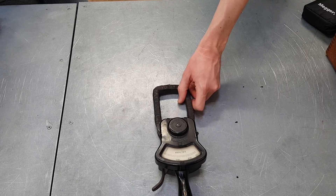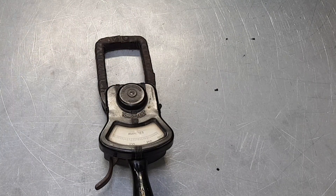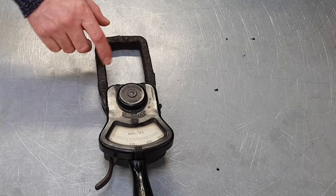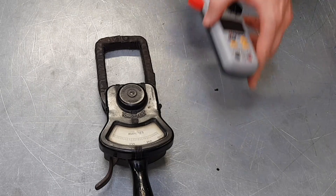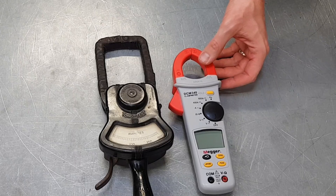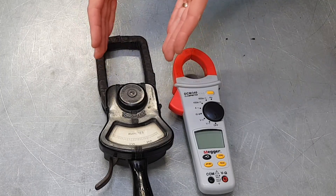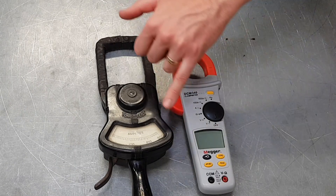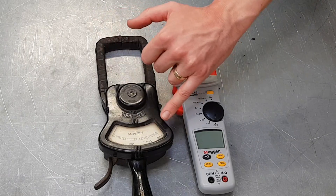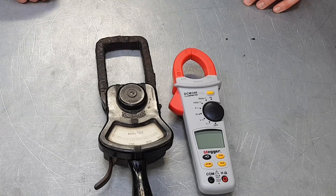Here's another quite brutalist bit of kit — a clamp meter, or tong tester. You just clamp it around your conductor in the middle there and read your current off the front. No batteries required — it's basically a transformer with a single turn of the conductor and a considerable number of turns inside to run the meter. I've also brought in a modernised version from Megger for comparison. The old one has beautiful Bakelite casing and a turned wooden handle, but it's limited to one scale, only going up to 200 amps.